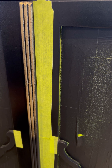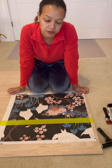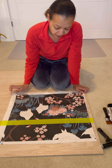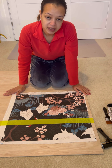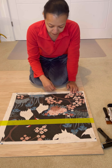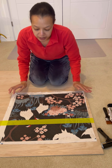Now let's get to the decoupaging — fabric onto furniture. To get the material ready, I would recommend washing the material first. No fabric softener or anything, just a general wash. After I'd washed it and it dried, I then ironed it. For this demonstration piece, I haven't ironed the bottom half — you can see it's nice and smooth up top but still a bit wrinkly down here. What I did with the original one — because it was a huge cloth — I taped it down at the bottom, then pulled it back and started the decoupaging from the bottom, working my way up each time, making sure everything was nice and taut.